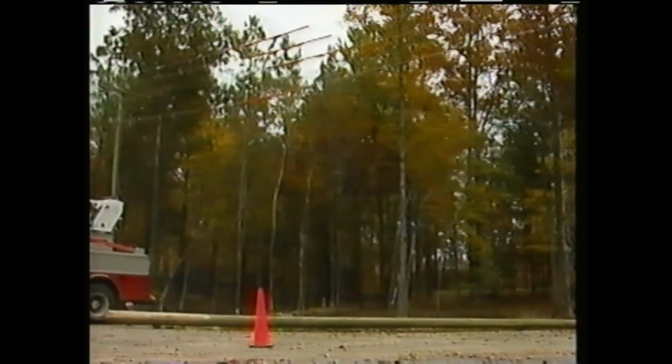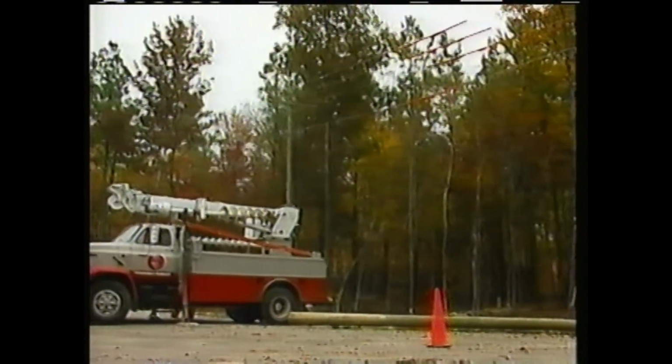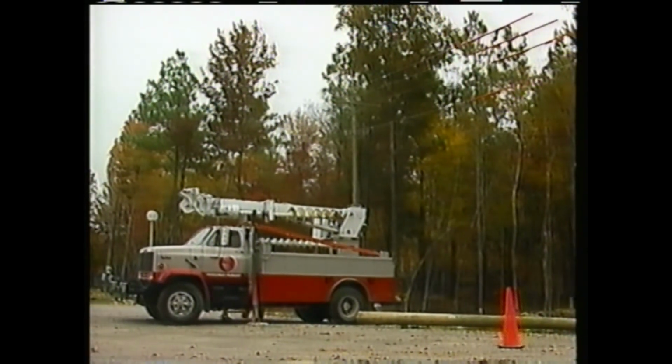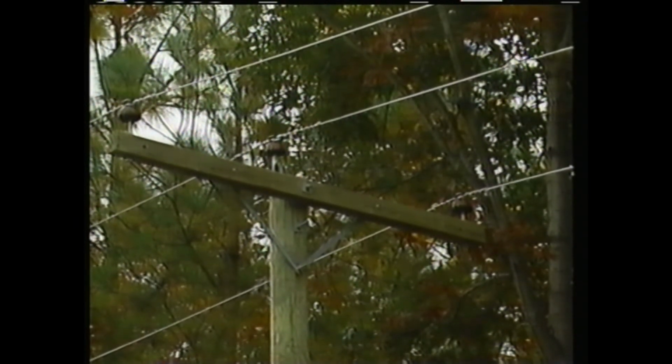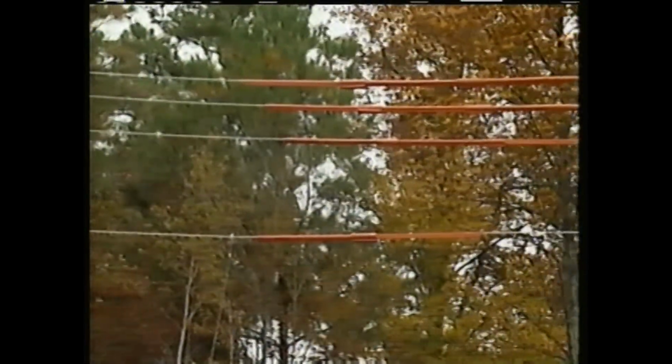First, this work site has several trees and an existing utility pole that will affect the raising and maneuvering of the new pole. There is also an energized three-phase pole-top feeder that may come in contact with the pole during the job. Because of the energized phases, the crew will not frame out the pole until after it is set. A wooden utility pole is not considered to be a good insulator because of the preservatives and possible contaminants. Therefore, contact with any energized source may also energize the pole.